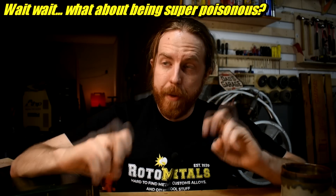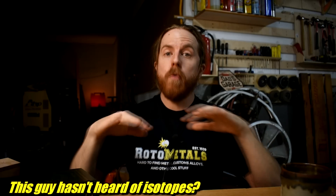If you're wondering what the main issue with aluminum is — aluminum is like an element, it is one thing. But all the aluminum around you is some kind of alloy, and if you just grab whatever scrap you got and mix it all together, throw in the cans and the extrusions and whatever else, you're probably gonna have a mishmash of different alloys and it's not gonna work very well. I've done that a lot and it caused me a lot of problems. Buy clean ingots of the right alloy and use that. Don't bother with the scrap.